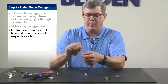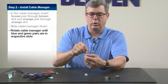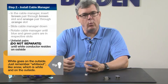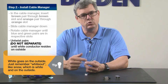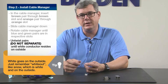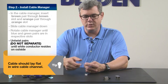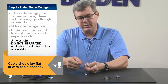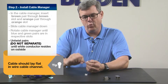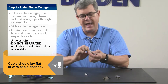These are lined up correctly, so I pulled the two pairs up. If I look at the RevConnect, you'll notice two grooves go off in one direction, two in the other — so two pairs go one direction, orange and blue, and then brown and green go the other direction within the cable. Now, I want to undo the twist on these cables and make sure that the white is on the outside. The color code for this is white on the outside — if you think of snow or whiteout, it helps you remember that white always goes on the outside or the corner. To undo the twist on a bonded pair cable, I don't need to separate the pairs; I just need to flatten out the twist at that last quarter inch. If I take the cable and put a small L into it, I can simply untwist the cable pair as it lines into that groove.